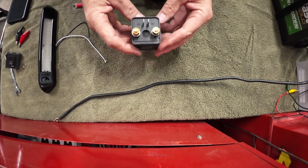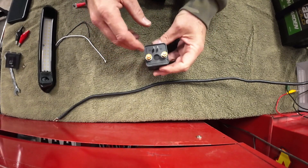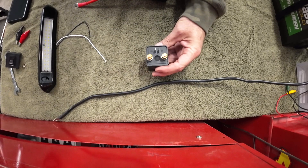You've seen a relay installed. Let's talk about basically how they work. These are super simple — don't make this complicated. All a relay does is take a small electrical current to close a switch to allow a bigger electrical current to flow through.